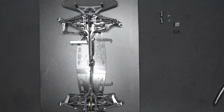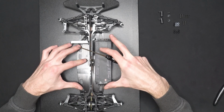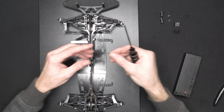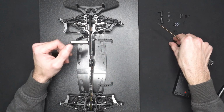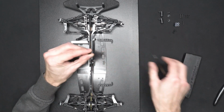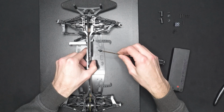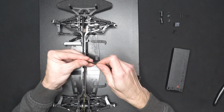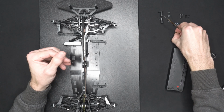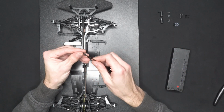And next we want to adjust the lateral play of the battery. So you see there is no retainer in the middle. So two options: either use a combination of button head screws and spacers. I know that in my case with these batteries, 3 black shims is a good approximation. So 5.25 millimeter. The play you want to achieve is around 0.2 to 0.4 millimeter.